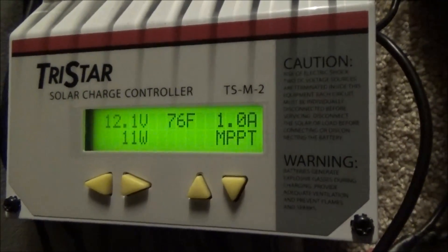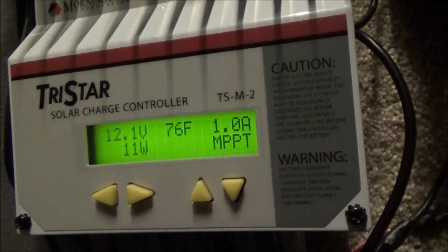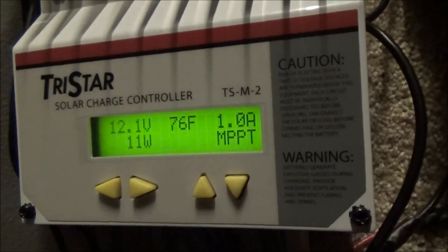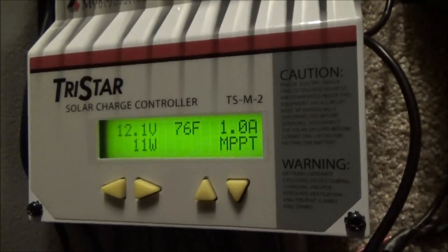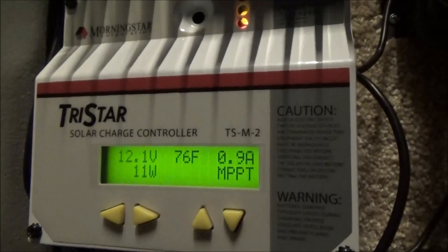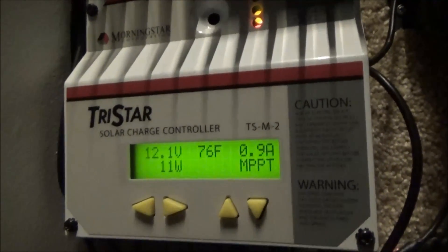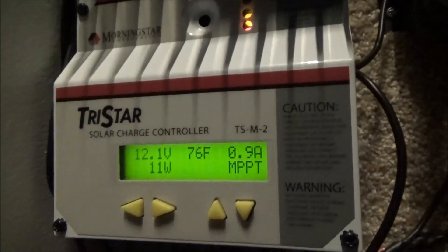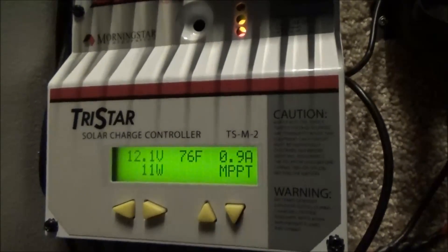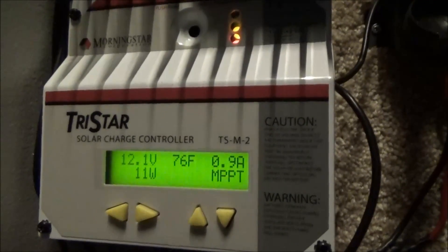For two weeks this is all I've been putting out. I've seen a maximum of 150 watts in the last two weeks coming out of my solar panels — that's nothing. The problem is that although I have 800 watts of solar and six batteries with 600 amp-hours of capacity, I have no usable energy and my battery bank is low. The weak link is the sun — it all depends on whether the sun is shining or not.